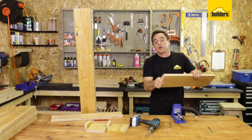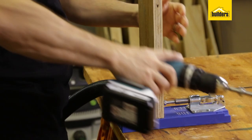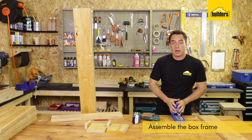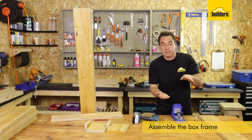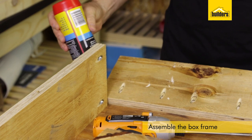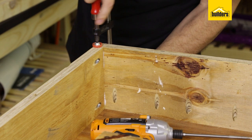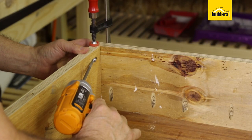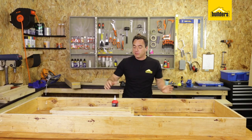Now I've got my two end pieces and I'm going to put pocket holes on either side of both pieces. That's the pocket holes done for the box frame. Now I'm going to start assembling it — I'll build it on top of the bench, put the slats underneath and screw those down as well. Remember it's always a good idea to put some wood glue between your mating surfaces, clamp into position, insert your Kreg screw, and you'll see how it pulls those two pieces of timber together to make a secure joint. My framework is done and it's secure.